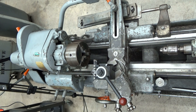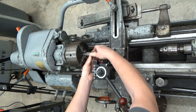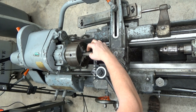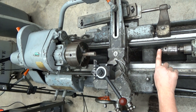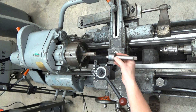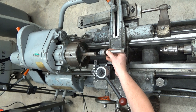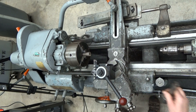In this video we're going to be talking about how to do some basic turning and facing operations. The first thing we're going to do is take our bar stock and throw it into the chuck and get it tightened up. Generally if we are turning short pieces we don't need to turn between centers. If we're turning something that's about four times the diameter of the stock, then we typically drill a center drill hole at the end and turn it between centers.